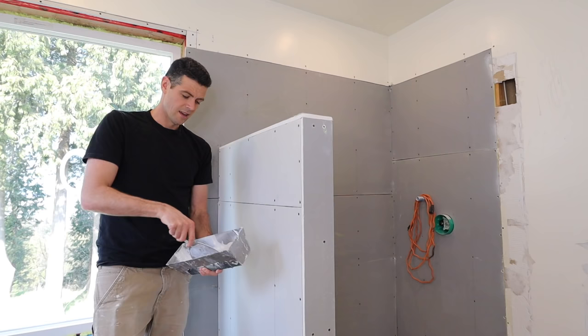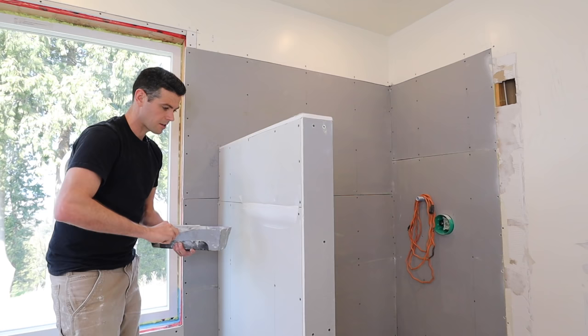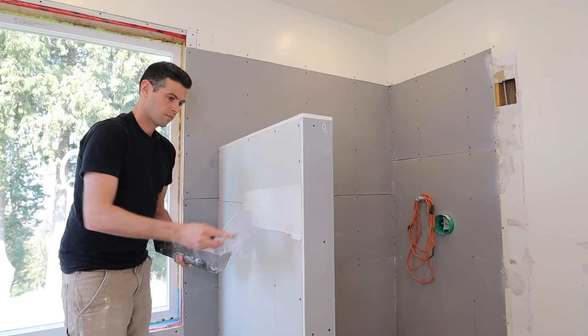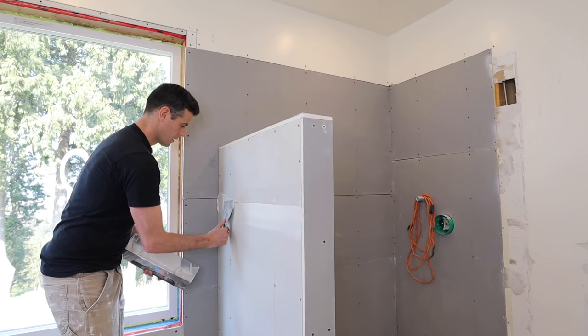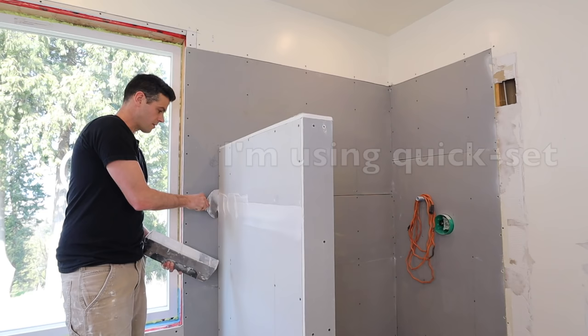The solution to this is just pre-fill it. As you can see, I'm evening out that flat gap. And then in the taping stage and the finishing stage, you just have to treat it like a butt joint. So it's that simple — there's no big mystery to them. You just have to flatten out that surface.